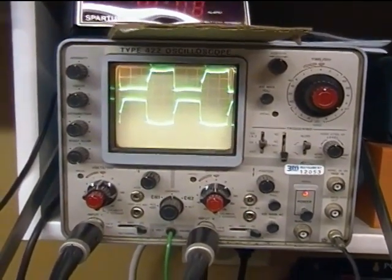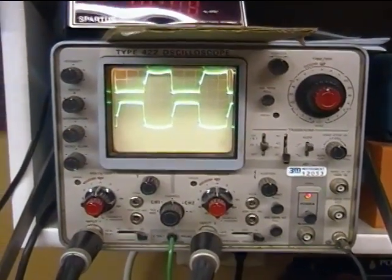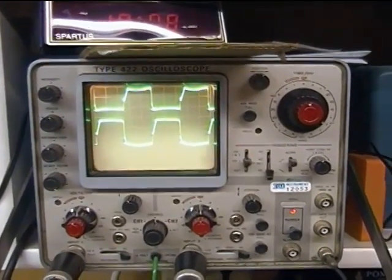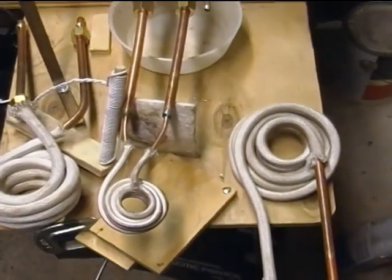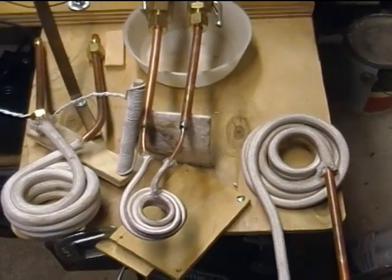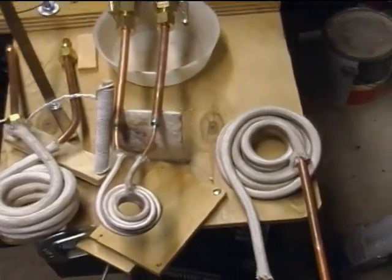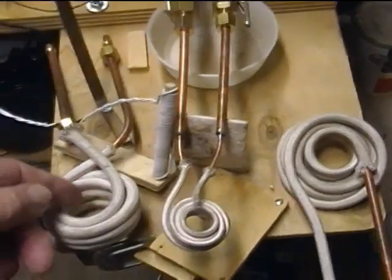Heat up to 104. Gates still look pretty good. I've noticed over the last couple of years that apparently either the MOSFETs or something in the gate drive circuit — the components aren't exactly equal — and so we get a little bit different wave shapes there. These days I'm kind of focusing on coils for annealing brass cartridge casings, but what I get out of that is different coil designs, and I've got videos out on a few other annealing coils. This one I would call good.